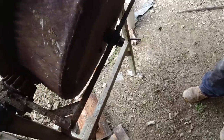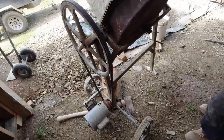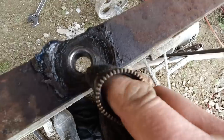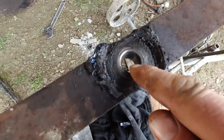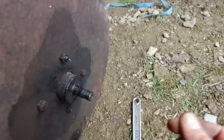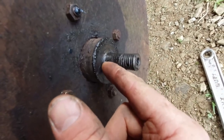It's still bloody turning. Why isn't that bearing turning? You don't want that turning - that nut - otherwise it's going to slug out again. So the problem we've got now is that it's been running on this, spinning that bolt for so long that it's worn out this piece that should be clamping on the bushing. So I'm going to have to do something there. That should be clamping this internal piece onto there but it's not.